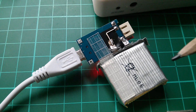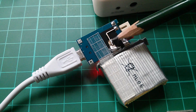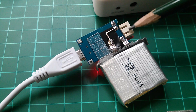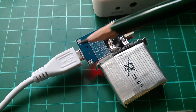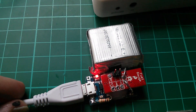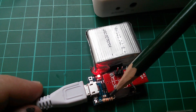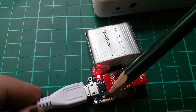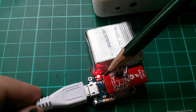It's not beautiful, but it is wired up. We've got the positive LiPo connection going to positive on the charger board, negative insulated from the back of the charger board through this wire to the negative connection. This is the output from the LiPo going through its battery protection components, and I am actually charging it now — you can see the red light is on. Now because this is a bigger LiPo, I should really change this resistor, because it's charging at 130 milliamps, and I could probably charge at about up to 300 milliamps, but it looks quite difficult to get to, so I think I might just tolerate it being a fairly slow charge for the time being.